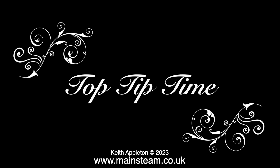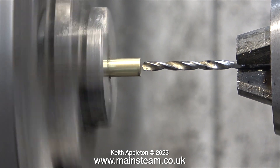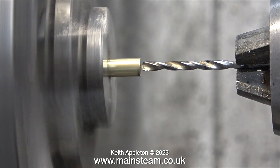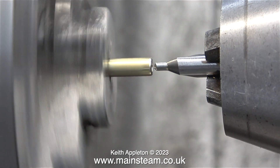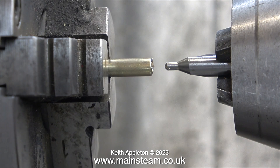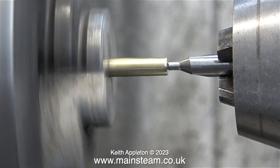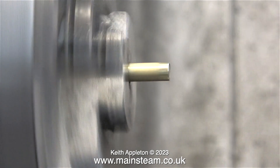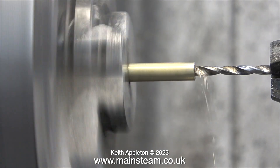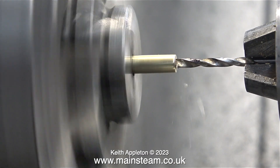Now it's top tip time — quite a few top tips, starting with a top tip on how not to drill a hole in the end of a piece of bar in a lathe using a very small twist drill. You can buy special short spotting drills, but I haven't got any. Instead I used a centre drill. One at a time I put the pieces of bar in the chuck and all I had to do was press the centre drill against the brass — I didn't have to turn the handle on the tailstock. This was very quick, very simple and very effective. Now when you use the twist drill, it doesn't wander about. The sequence is running at four times normal speed as I drill a hole down the centre of each of the pieces of brass bar.